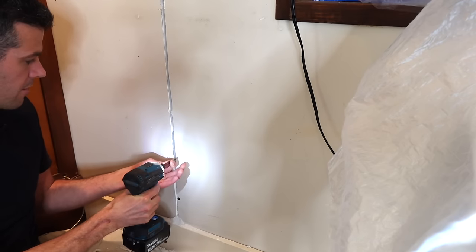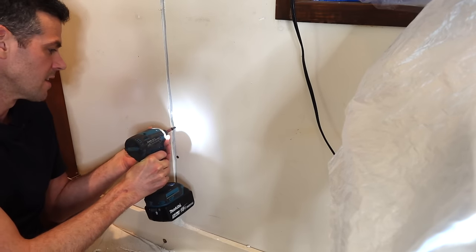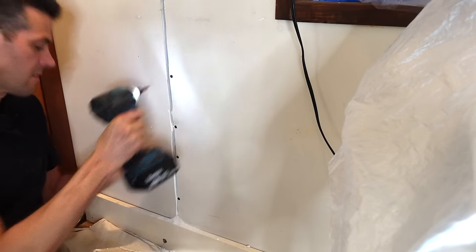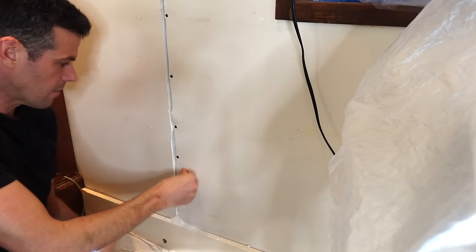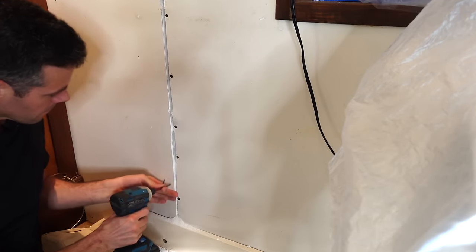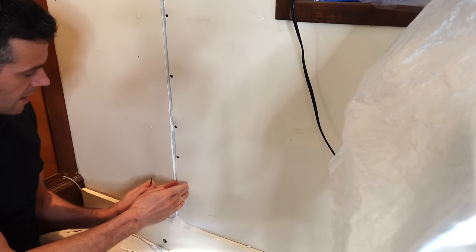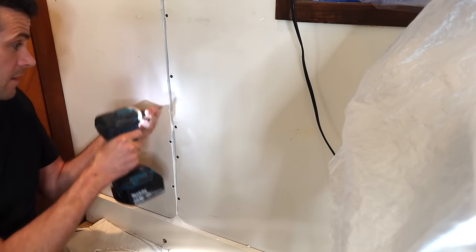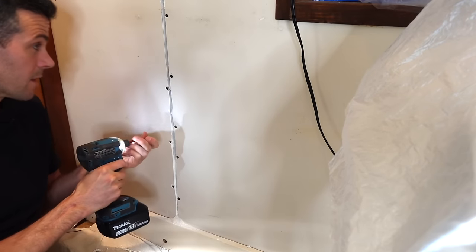I'm just taking my time with the impact driver. Yes, I have drywall drills, but I needed this for something else and I didn't feel like bringing both tools inside the house. For a small repair like this there's no need to get the specialized tools out — it's not like I'm hanging a few sheets or anything. I can see it's not moving now. There's like a 1/8 inch lip here where this board kind of needs to get sucked down. This was the more solid board, but it still needs something. Thankfully there is wood there, so the screws are able to grab — because if they weren't, that would be a pretty big challenge. I would just have to angle the screws to the best of my ability hoping they're actually doing something.